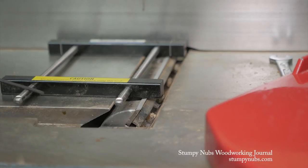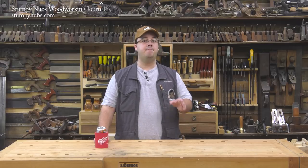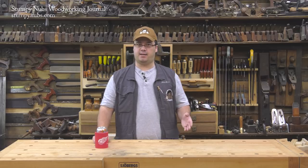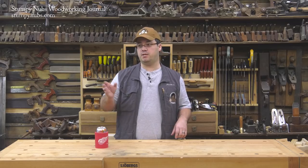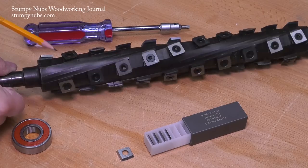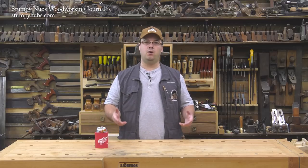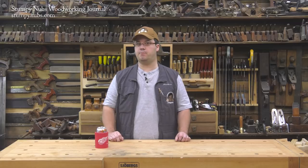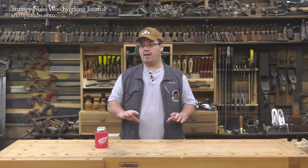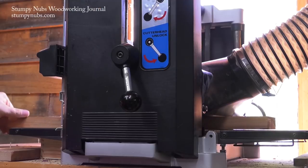How many times have you replaced your high-speed steel knives in the last decade? Factor in not just the cost of the knives but the hassle of aligning those things on your jointer. After our original video I got comments from people saying they sharpen their knives so replacement costs weren't a big deal. Maybe that's true, but how many times have you gotten a nick on a freshly sharpened knife right after you started using it again? That is the most frustrating thing. With the helical cutter head it just takes a minute to fix — you rotate the one cutter that has the nick and you're good to go. You don't have to resharpen or, most likely, just live with that nick for months until you change them again. Having the ability to eliminate that nick without the hassle or expense has been an enormous game-changer for me.